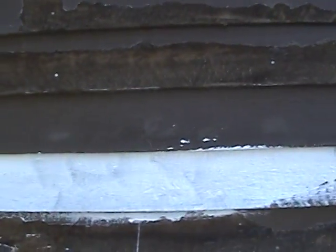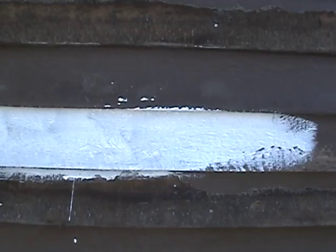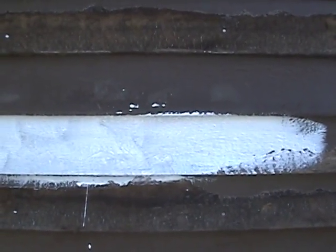What you want to do is take your brush. I use a little cheap two-dollar brush. You can also use white china or black china oil brushes that are specially made for oil — they cling to oil better. White and black china brushes are basically horse hair; they're not a latex brush, they're an oil brush. You can also spray this on, but spraying oil is tricky because oil droplets can travel with the wind 20 to 30 feet. If you have a car out here anywhere, you can get it on the car and be in a lot of trouble. So I would suggest you probably do it with a brush.